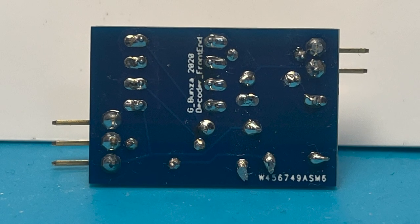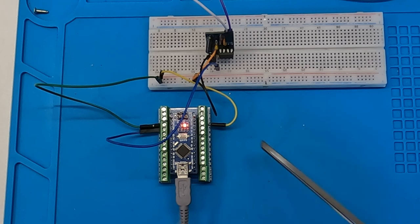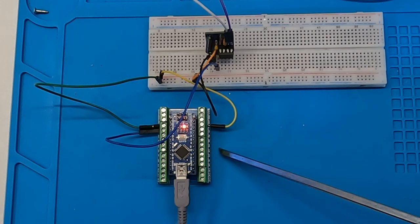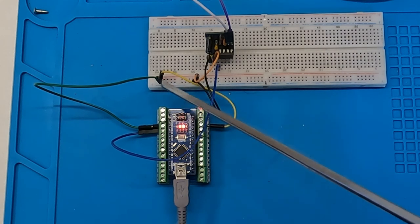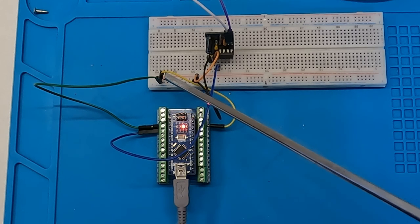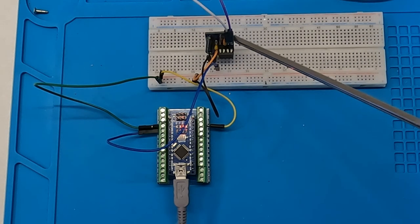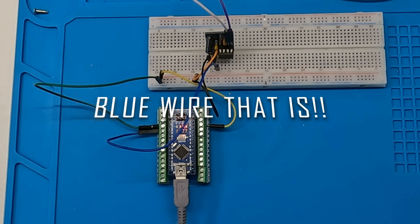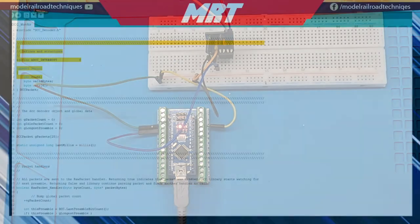There's the finished product with all the components soldered on. That's the front side of the board and that's the rear side — you can see it's quite a tiny little board. So we've got 5 volts going into the Arduino extension board. The green wire and the yellow wire are the negative and the positive going to the bus. This little circuit needs 5 volts maximum, a negative and a positive, all marked on the board. The other yellow wire is the interrupt pin coming out, and the blue and white wires at the top are the DCC signal coming in to the board.